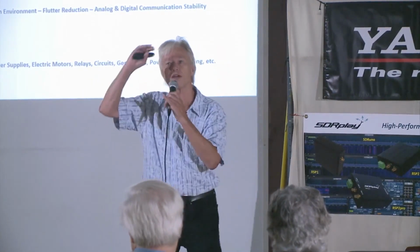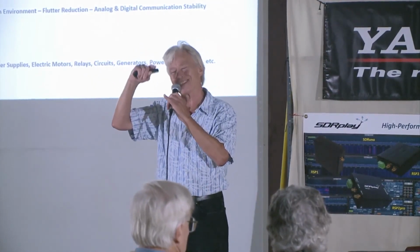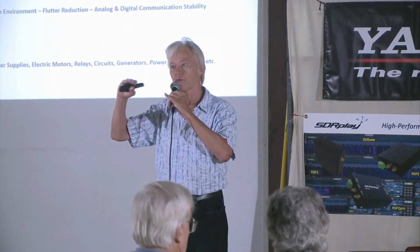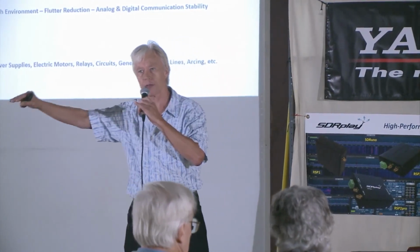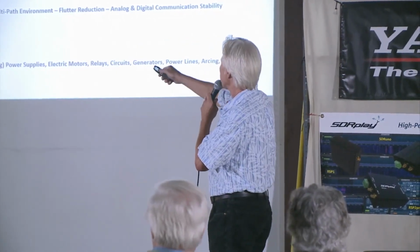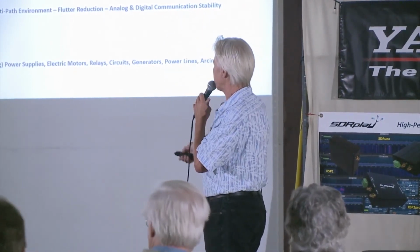So even if your very peak signal when you're at a hilltop is slightly less, it isn't with the 9-inch, but slightly less, your effective overall performance gain, your obstructed range is actually greater because you have a stabilized signal. All right. Phase diversity I'll talk about. All of that comes into the new term mean effective gain. Okay? That's what MEG is all about, taking all that into consideration.